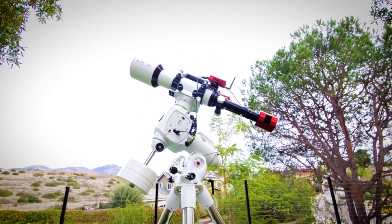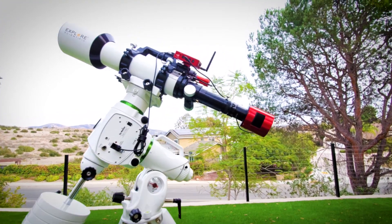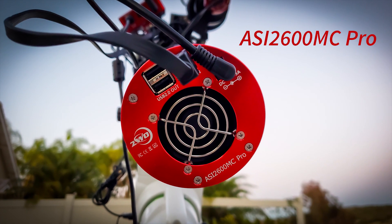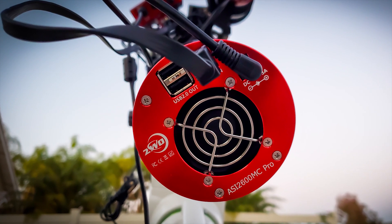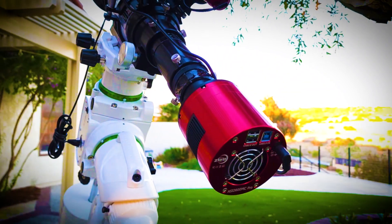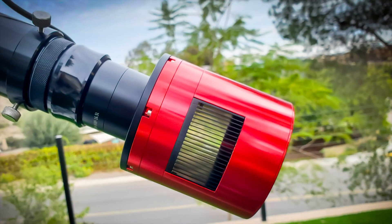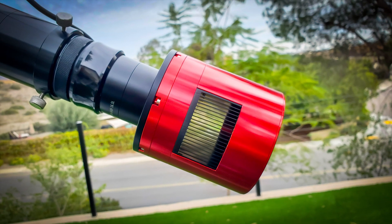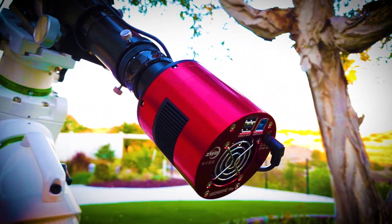Let's go ahead and get into the pieces of this rig. At the very back is the star of the show — the full color single shot dedicated AstroCam. In this case it's a ZWO ASI 2600 MC Pro camera. This camera is phenomenal and I highly recommend it. It has a built-in cooler, which I like because during summer months where heat becomes an issue, it can cool the sensor down to below zero to prevent things like amp glow. It also has a built-in dew heater and shoots in APS-C format, which is just smaller than a full frame camera sensor.